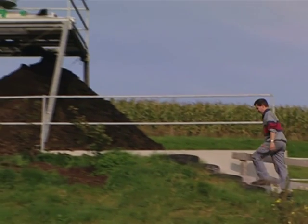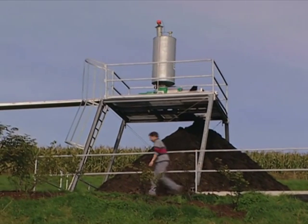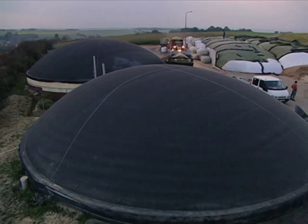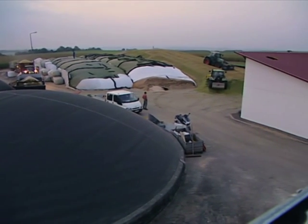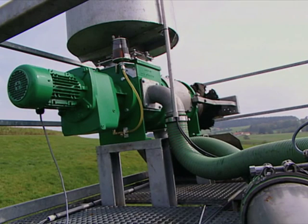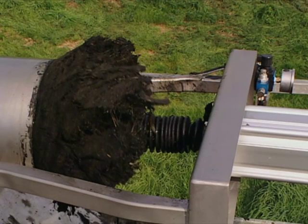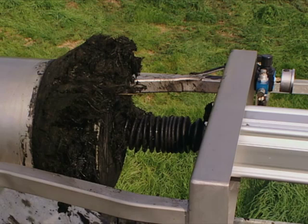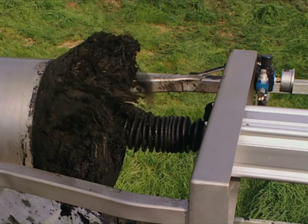The Agricole separator is designed so the pump is only activated when needed, making it incredibly energy efficient. With this efficiency in mind, the Agricole designers have developed a system which minimizes pump usage. The separator is placed at a high level so that solids can drop by gravity. They have also used their experience in developing the optimum pressure setups for different dry matter contents of the digestate based on the input feed material.